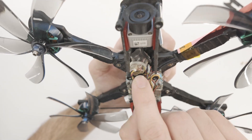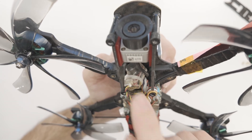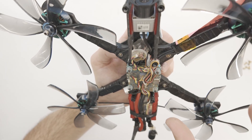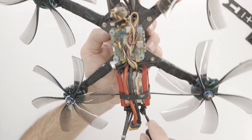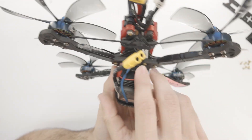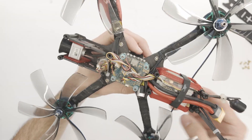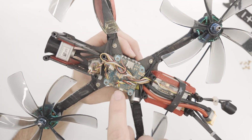Another little bonus thing here is this is a beeper, connected to the flight controller for power. We can also actuate this on a switch. The beeper is really nice because when you lose your drone — and notice I said when, not if — when your drone goes down in tall grass or a tree or wherever, you can actuate that really loud beeper. This one also flashes an LED really bright. That can be very helpful to find your drone. Also wired up to the flight controller, we have the receiver — this little guy right here. This is a crossfire style receiver, and it matches the crossfire module on my transmitter. That is how we actually are able to control the drone with our transmitter — it's a radio link.